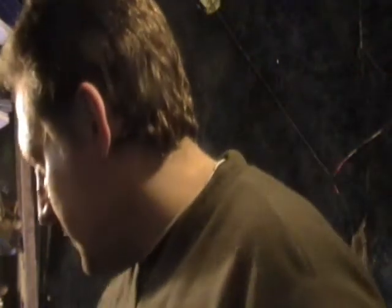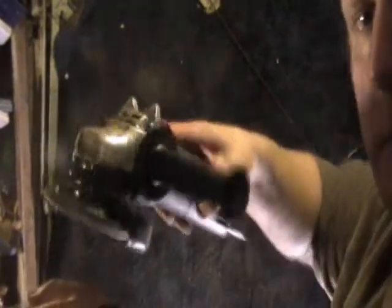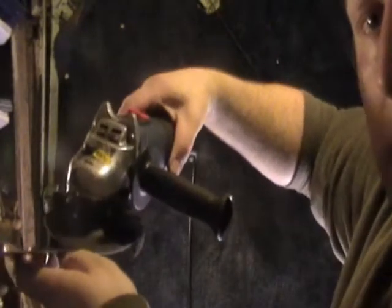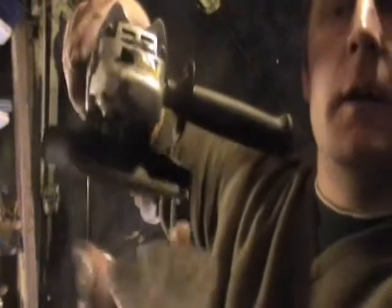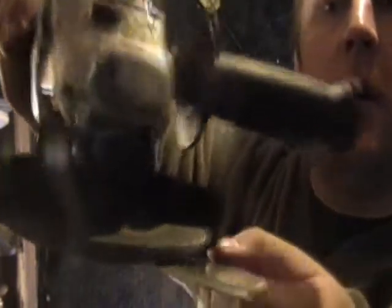Now what I've done is I've used a combination of the angle grinder with the grinding pad on, this sort of flap disc thing, and basically knife like that. I've just gone along, there's a camera in there. I've just gone along like that, and the other side like this, in order to put a coarse bevel on it,